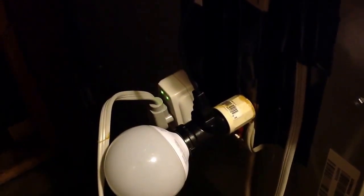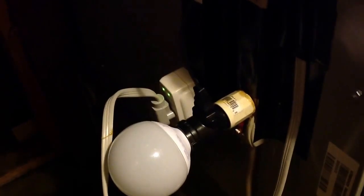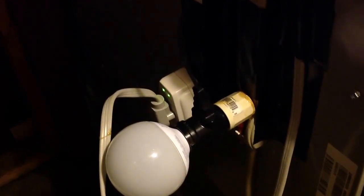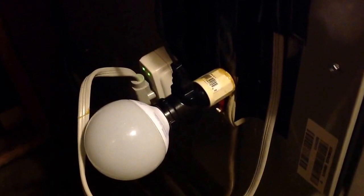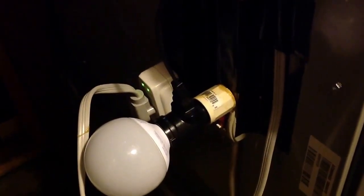Let's pull that out. A transfer switch is going to be going one way or the other if it's the right kind, and mine was — I had it inspected to be sure. The other way to do that, which would be approved by the National Electric Code, would be this method: you pull that thing out of there, and there's a plug right up there just to the right of that red switch — another power strip that would go to the generator, completely isolated from the utility. And then that light right there comes on when I switch that power strip on, giving me a little ability to see what I'm doing. There's another light on the ceiling connected to this generator power strip as well.